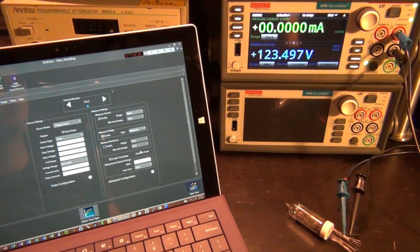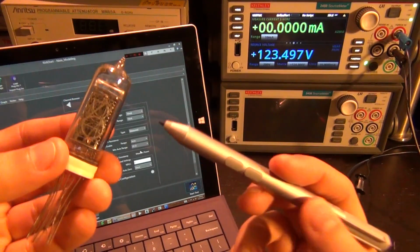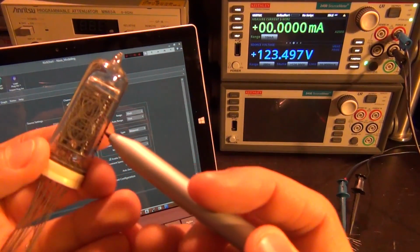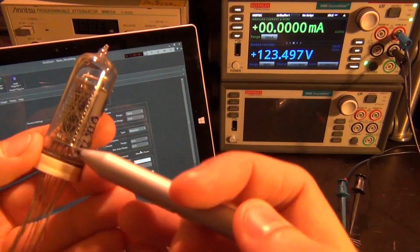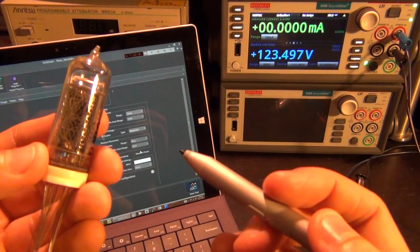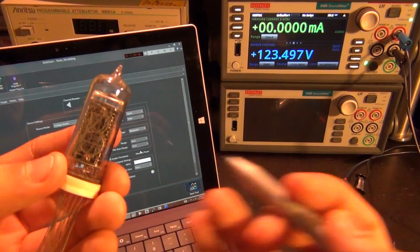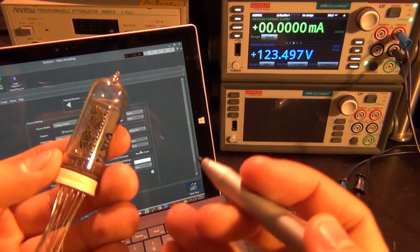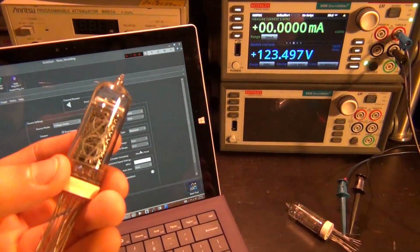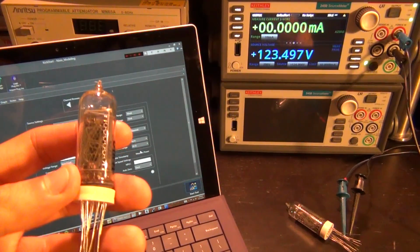Now, I'm not going to look at thermal effects, but I'm going to look at this Nixie tube, which is a neon tube. These things also exhibit hysteresis, and the reason for that is that you have to reach a particular strike voltage in order to create the plasma gas to be conducting electrons through it. Once you reach that excitation point, you get a nice flow of electrons, and then you don't need to maintain that potential through the ionized gas in order to continue the flow of current. The potential can drop significantly. As a result, you have this hysteresis effect between the strike voltage and the maintenance voltage for these things to basically continue to glow.